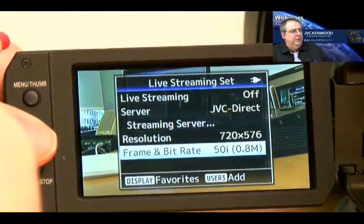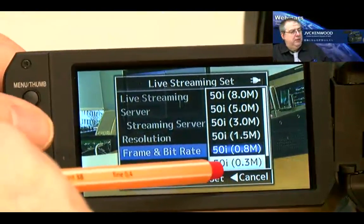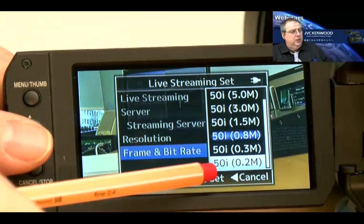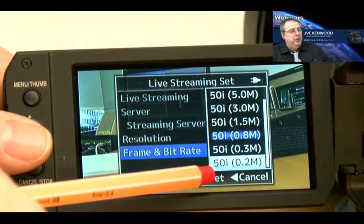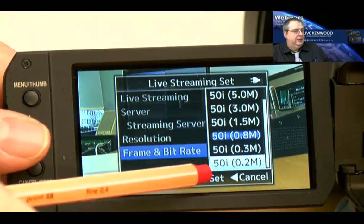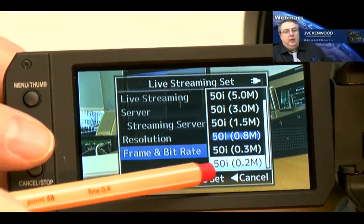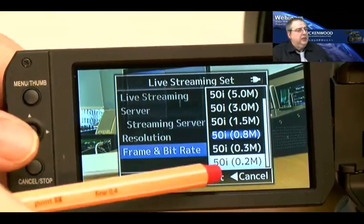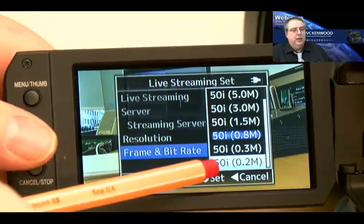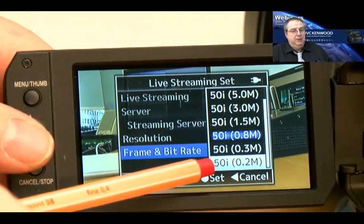And also for the bit rates, we go from 0.3 megabit, even lower, 200 kilobit per second. And this 200 kilobit is usable in case you have a weak satellite connection. That means you are in the desert and you want to make a transmission. Of course, the frame rate is low, but the audio is good. So you can still make a reportage from that area to your broadcast station or directly to the web for breaking news by a simple satellite telephone.